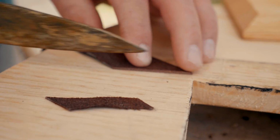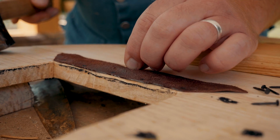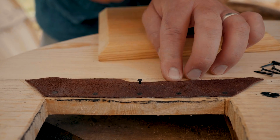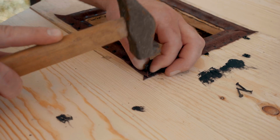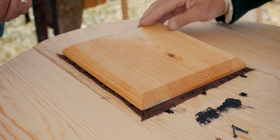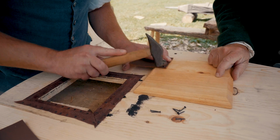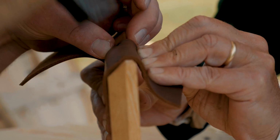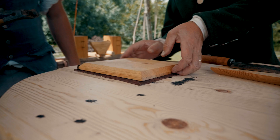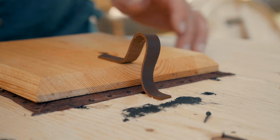So before we assemble the main pieces of the bellows, we want to assemble the valves. On the originals, the leather pieces that make up the gasket were flat. Ours, we bunched up the leather and then nailed them really close together, so it creates a gasket. Then we've also nailed on the very thin leather hinge, and a keeper strap on the front, and that'll keep it from opening up all the way and getting stuck on the inside.